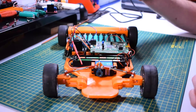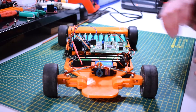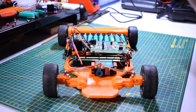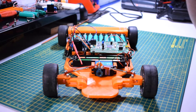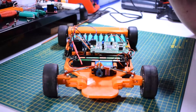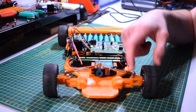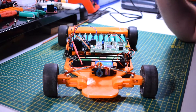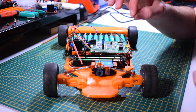To conclude, I'm really pleased with how this turned out. It's proven to me that 3D printing an RC car is feasible — it is possible. I'm going to take everything I've learned from this and take it forward to version 2. There are little things like stopping the nuts from coming undone when you're steering — nylock nuts, they're a lifesaver. There are a lot of tiny little things you tend to overlook when you think about this at a higher level, and then when you try to build it, all those little things add up.